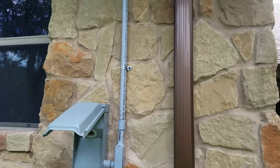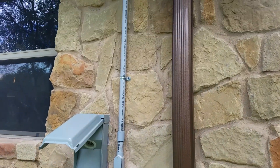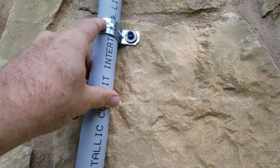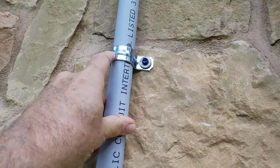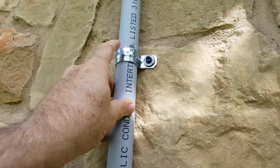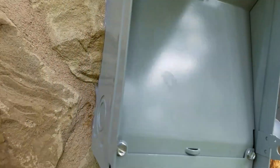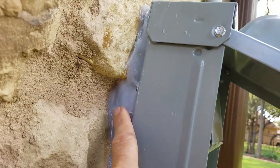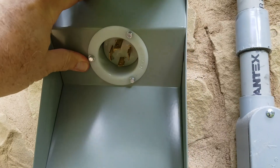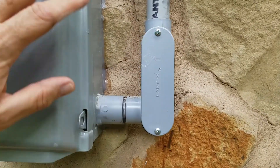I finally finished. I didn't paint the conduit — I may let it sit for a while. I got the little one-screw conduit holder on here. I had to go up a level — I think it's one-and-a-quarter inch to fit over the one-inch PVC, which is actually made for one-and-a-quarter metal conduit. I got all the caulk in here and put a bunch of foam in too — I just don't want water going back behind there. The plug fits, and I may get a little piece of foam or cap to put on here, but it closes and I can lock it.